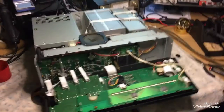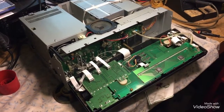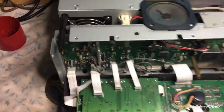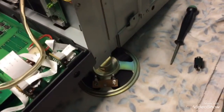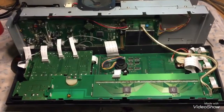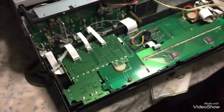Right here you're seeing the 775 DSP taken apart. Top and bottom covers are removed, and just the side screws and top screws that you can see right up here — this is what holds the front panel, which is the plastic bezel. There are two screws on the side. I did prop up the chassis with some speaker magnets, which gave you the clearance to flip the panel flat. I also put some padded protection under the main VFO knob, just so it doesn't lay flat.